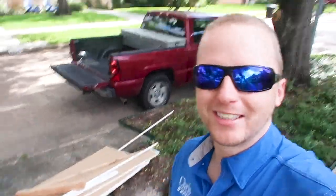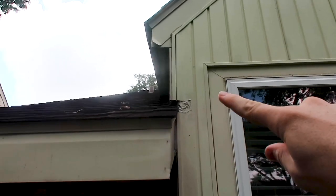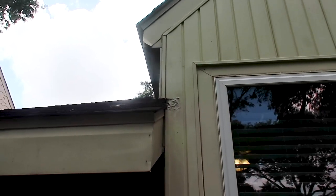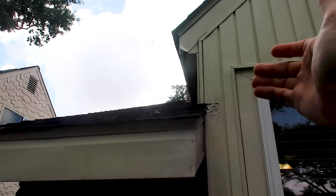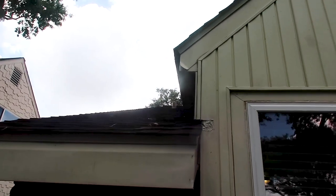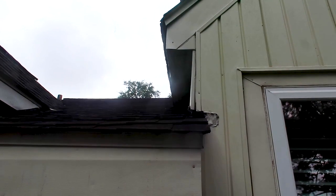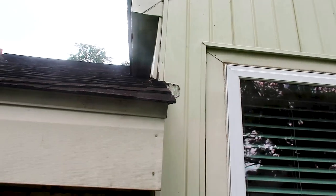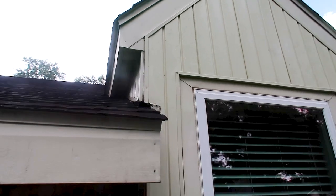When I said better than most, I mean it's better for me — because when you see wood and sheetrock sitting right in front of the house, that means it's good for finding stuff. We have some flashing issues around the window. You can see they've had issues right here, so we'll go inside to see if we have any water penetration around the windows. Being a flip, it's probably freshly patched and painted, but the flashing should protrude out of the siding a little bit — the flashing's not protruding very far, and they're using caulking to seal up the siding. Not an adequate repair — very temporary, actually.